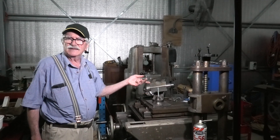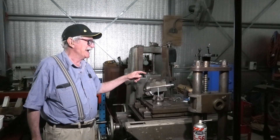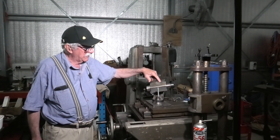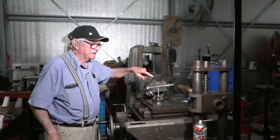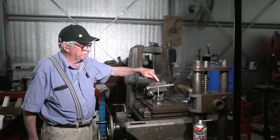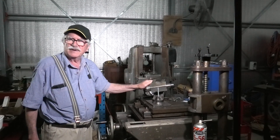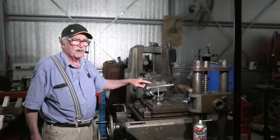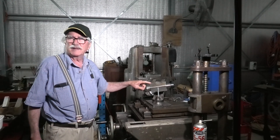Another one I'll make with three and six. The pivot block in there had to be linished away at an angle because the convergence of the two parts meant the pivot block was fouling the main body of the grinder. I've made up a pivot pin this time — I threaded both ends of it in case I put the wrong end in; I can always put a bolt in a slide hammer and extract it.